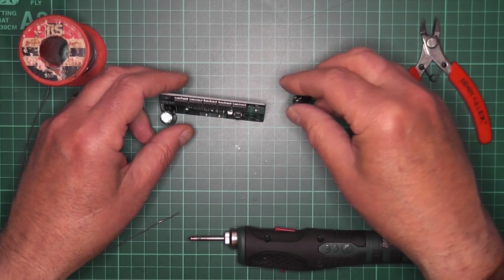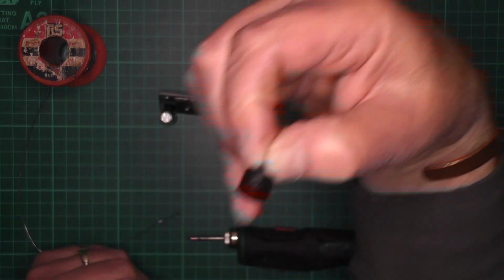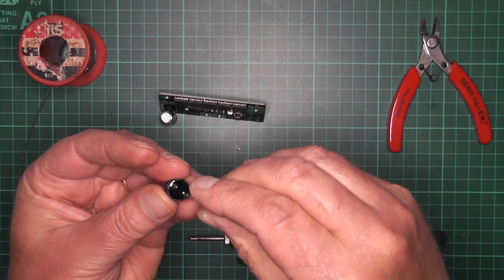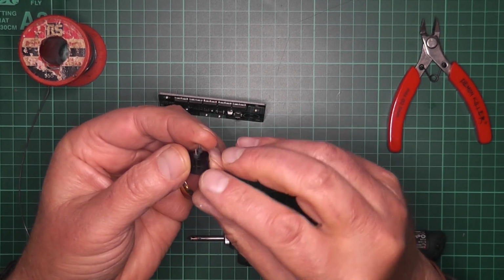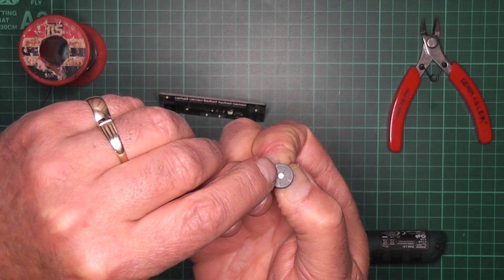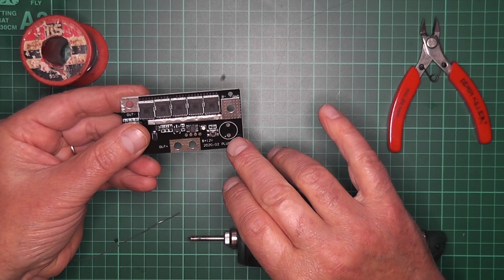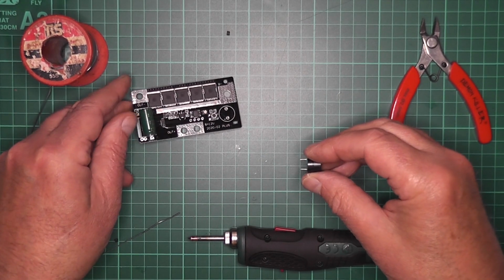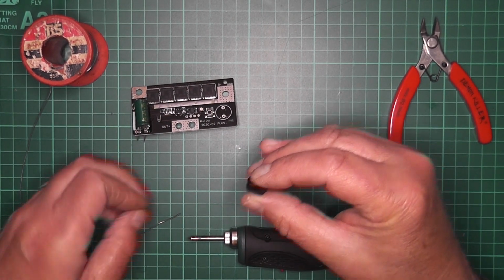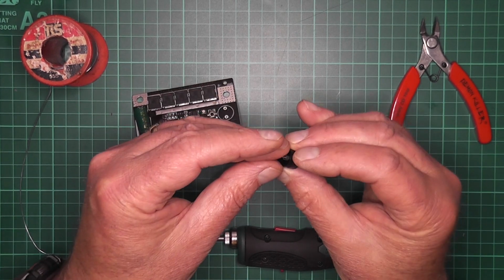Now the little buzzer, again, it's not supplied in it, but the buzzer, it actually shows positive. Just says positive there, and if it doesn't say positive, it's generally the one with the writing on it on the side, while the other one is negative. Now this one again, it actually has a tiny little positive there, and on the board, same thing again. The positive is shown here and the negative is shown there. Now ideally keep it a little bit proud of the surface of the board. It was like that on the previous board I removed it, so I'm going to keep it the same way.